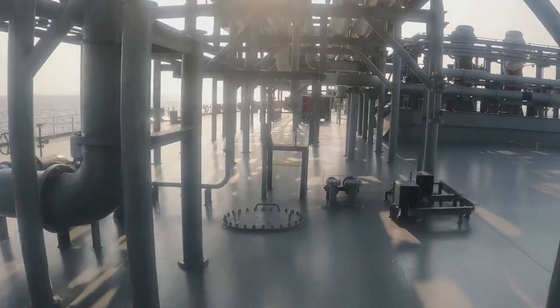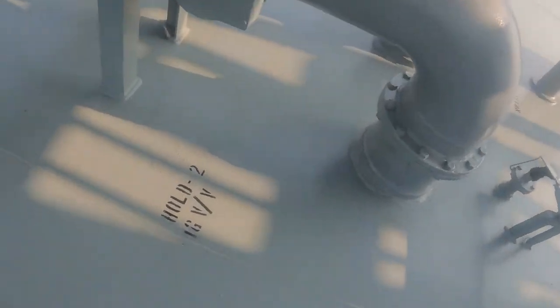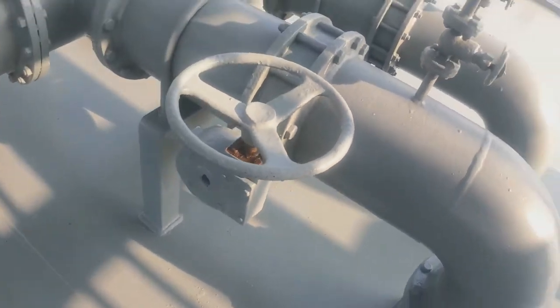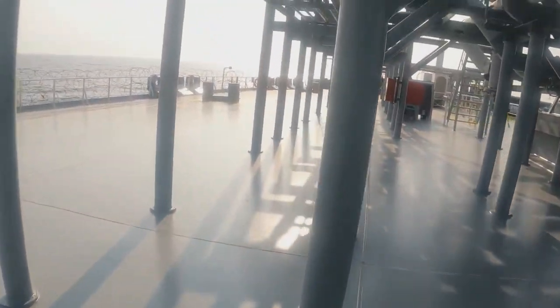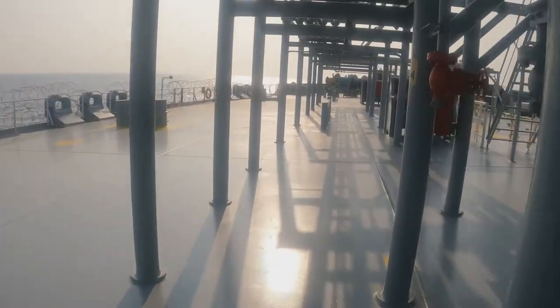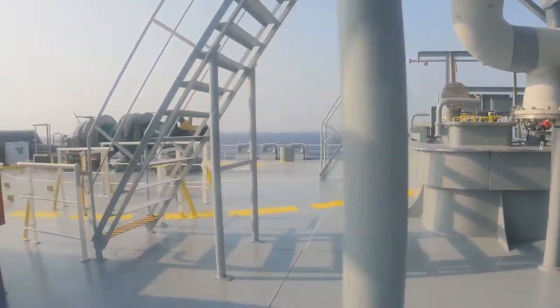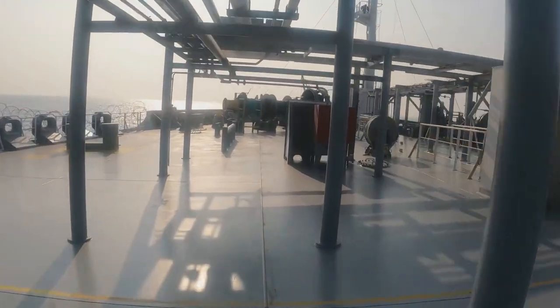You can see these are the cargo hold IG valve stencils. This is your cargo hold IG inlet valve — you use this when you want to put IG inside your tank to maintain cargo hold pressure. Now heading to the forward: we have cargo tank number one, which has the same equipment as mentioned for tank three. We're now heading to the forward of the ship.